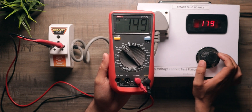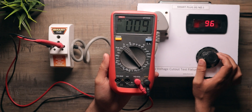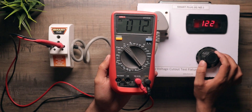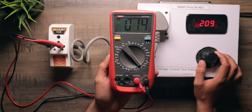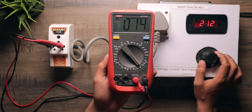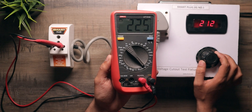The same goes below 170. As soon as the voltage goes below 170, the power will be cut off. And again, when it comes back to the safe range, the power will resume after 5 seconds. It has a startup delay of 5 seconds, which is very important to protect your devices, and that is actually very smart.